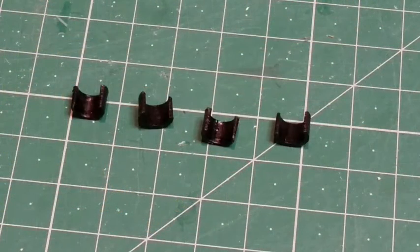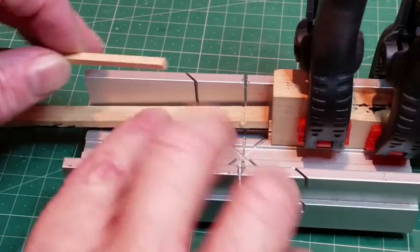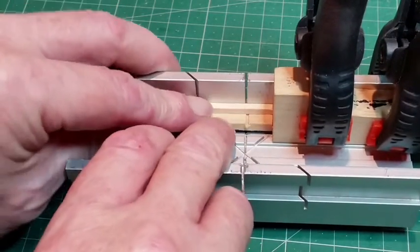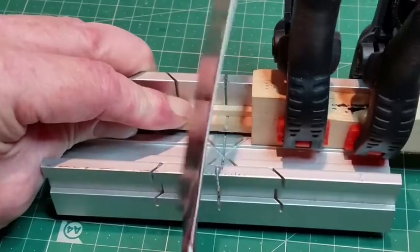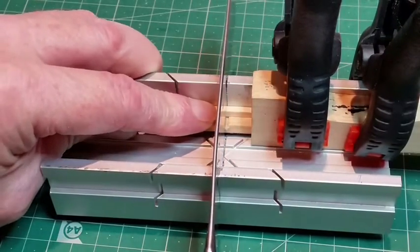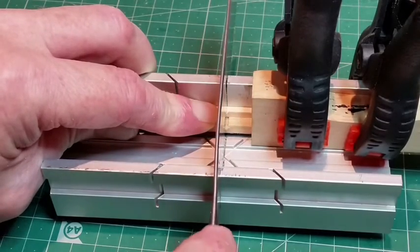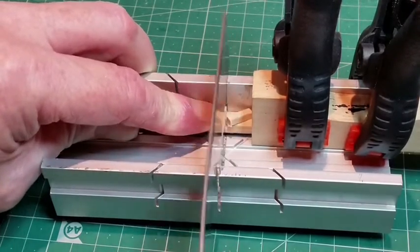Adding the forecastle timber heads, take the four semicircular castings and paint them black. Construct 34 timber heads from 3x3mm wood. Each of them should be 10mm long with a 3mm tapered top section. You can make a jig from a mitre block with a wooden stop clamped in, as used in stage 79, to ensure that the posts are all cut to the same length.